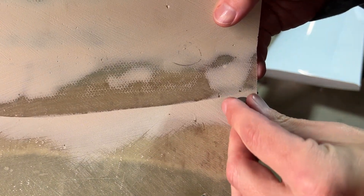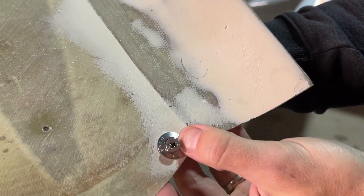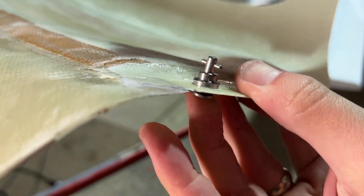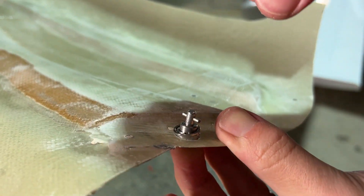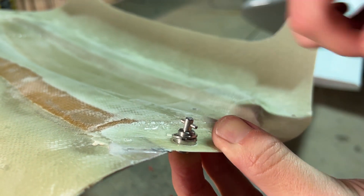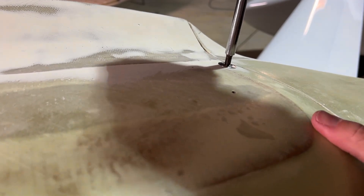All that's left is to open up the outer flange to 15/32", and then we can test our fitting. To hold this in place on the back side, there's a lip and a snap ring that goes over and presses down. I think there was a tool to install this, but I lost it, so I'm going to have to improvise. One down, eight to go.